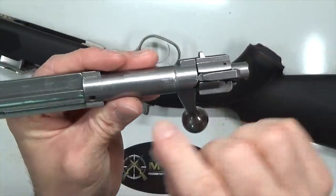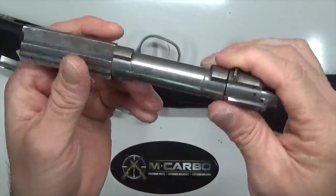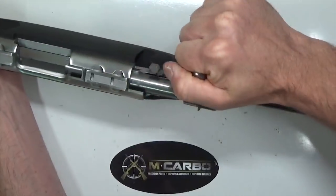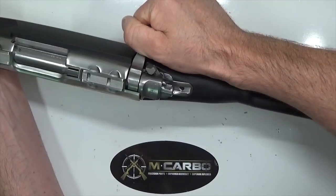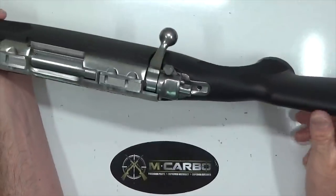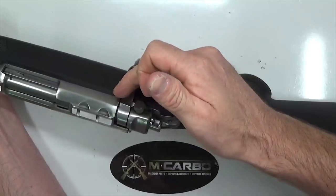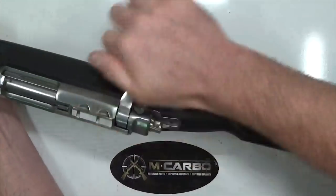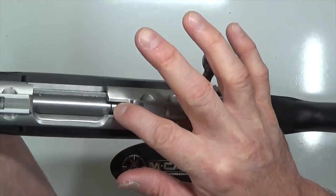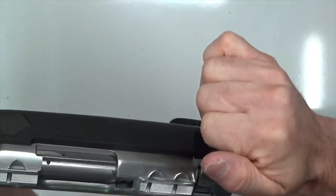All it's going to do is ensure these two halves are mated up nice and snug. Now we'll insert the bolt back into the receiver to confirm our shim is the appropriate size. Make sure the cocking piece is on that little divot — not on the flat portion — and insert the bolt and lock it. That's smooth — that's exactly what we want. We just took out two thousandths worth of clearance and play. The breech and the bolt are now one unit, operating like they're supposed to be. No slop, no play. Seamless.